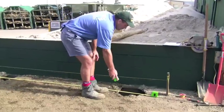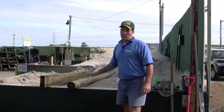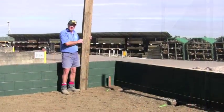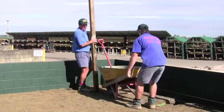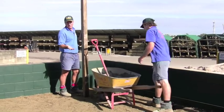This hole here is at 2.3 meters at the center and the center of this one is at 4.6 meters. The rule is if you have a retaining wall 800 millimeters out of the ground, you put your posts in 800 millimeters deep — so that's where we want to put our posts in the ground. We just need some concrete which we've just mixed up.